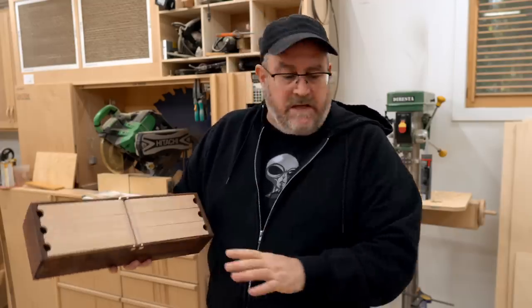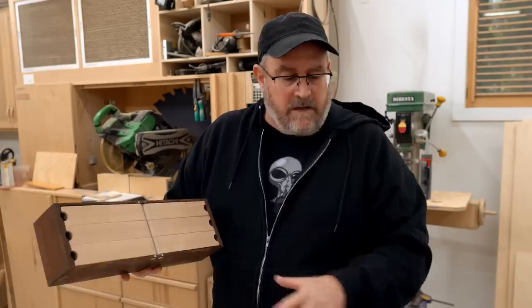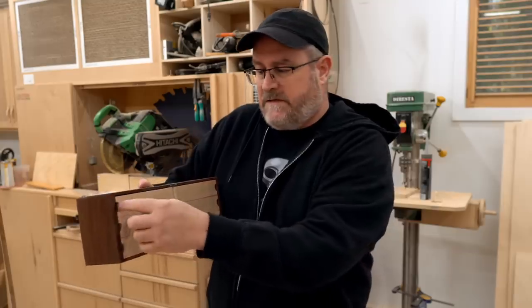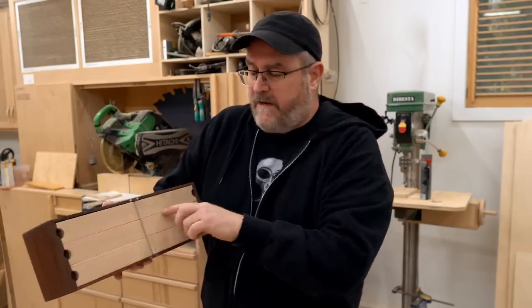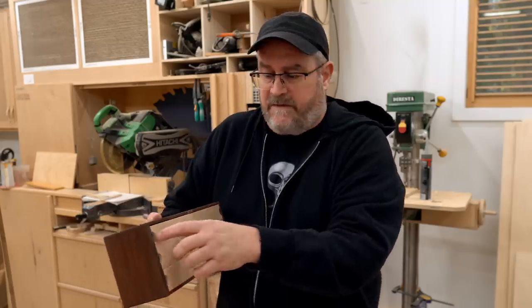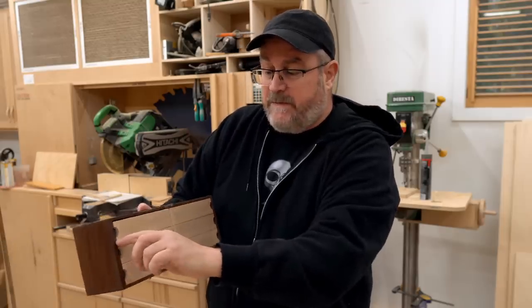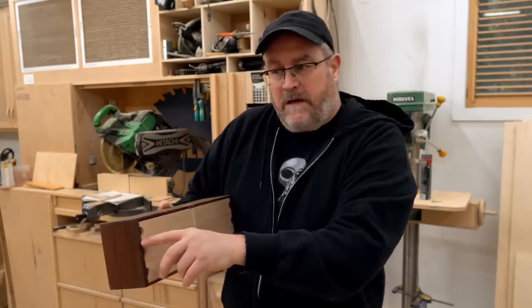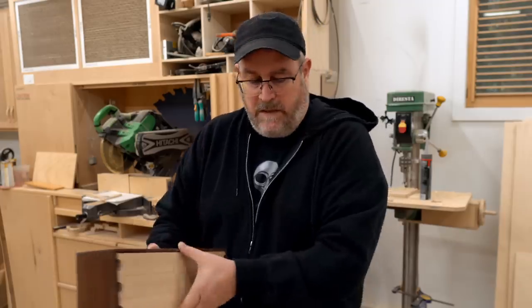So I made this in three units. Originally I was going to do it in one single tall one with dividers between every drawer. Then I thought, well, what if you make it in three — and then you'll be able to just use three drawers like this and they'll work relatively well. A lot of people suggested washers in between. You can do that. Or you can just put thin dividers in through here, just on the front — that's all you really need. Just a strip that's one inch wide and about an eighth of an inch thick between them. It really doesn't even need to be fastened on the ends, although it would be a good idea to dado that in on the ends. I like the way this looks, both in my mind's eye when I was designing it and when I drew it out in SketchUp.